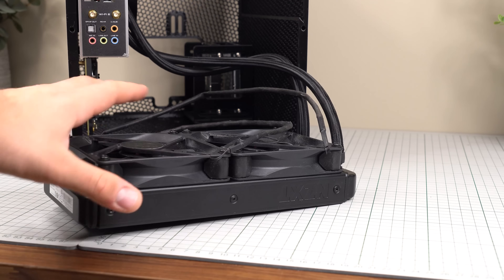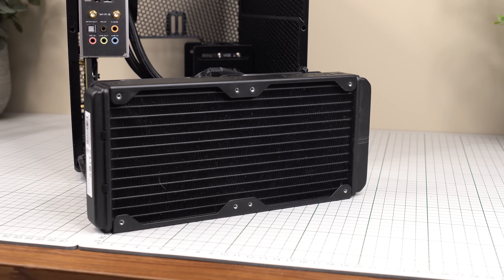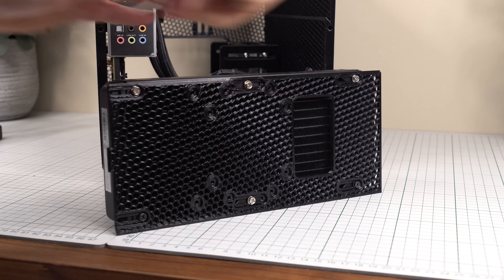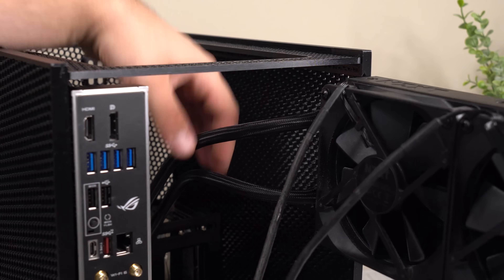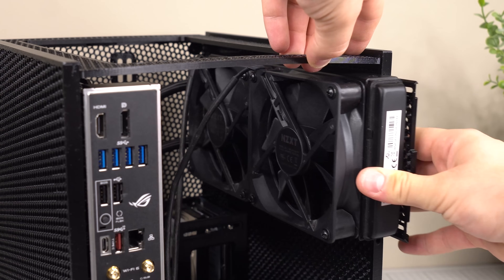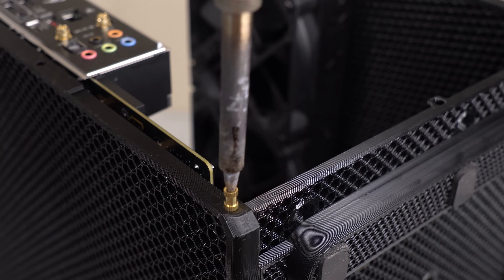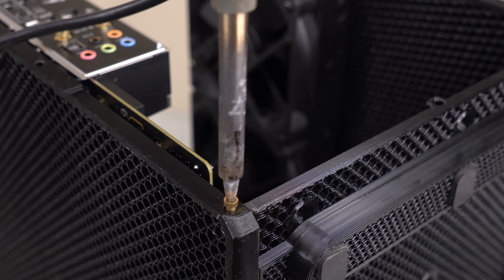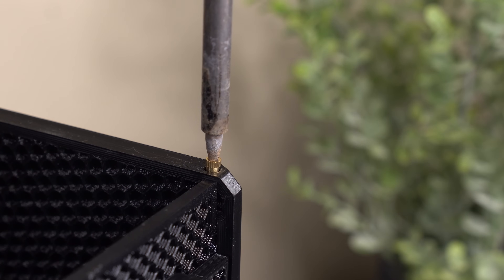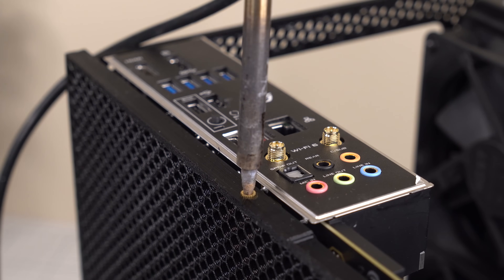Back to the side-mounted multi-mount. Personally, I won't be using hard drives here. I'll rather be using it for my 240mm NZXT liquid cooler. It simply mounts right onto the pre-made holes and slides right into place. As mentioned, the sliding plate locks into place once the rear panel is attached, and the rear panel is secured using M3 by 10mm screws screwed into threaded inserts carefully melted into each of the five mounting points. These can be melted into place now or before assembly, whichever you prefer.